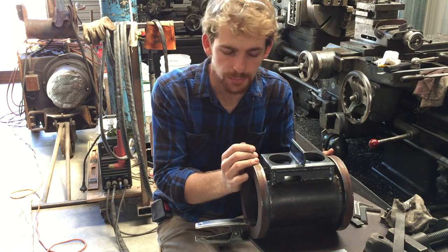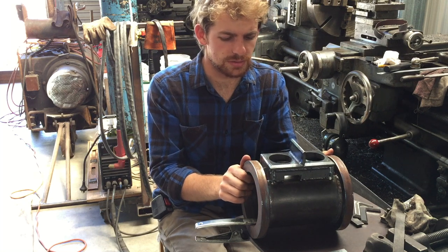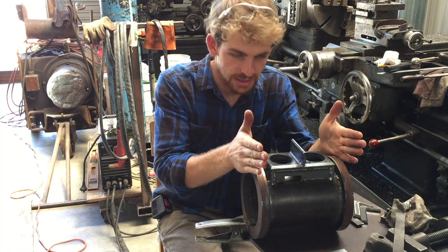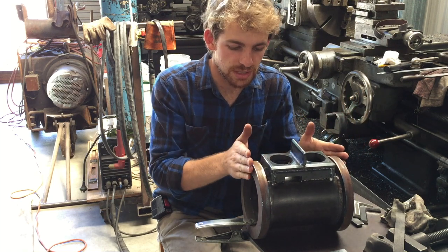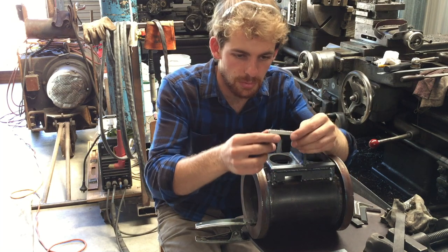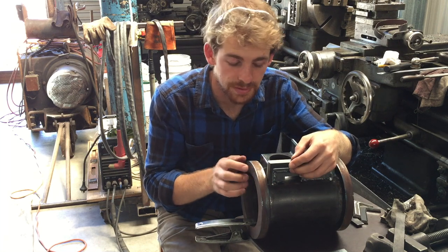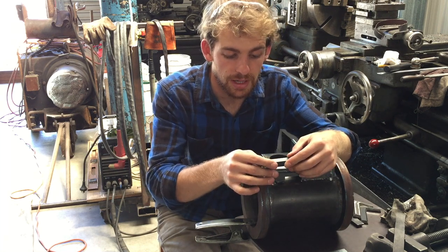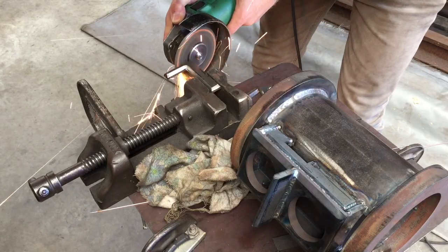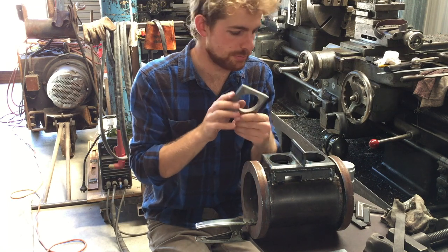what was supposed to be 16 millimetres, but by coincidence, that saved me, because had I had these cut in 16mm, there would now not be enough length left in the cylinder to machine the ends of the flanges. But it has meant that my little filler pieces, which fit in here, no longer fit in here. And I need to take about half, or just over half a mil off this face, each end. And then I've made this tool, which allows me to line up the valve seat bores.